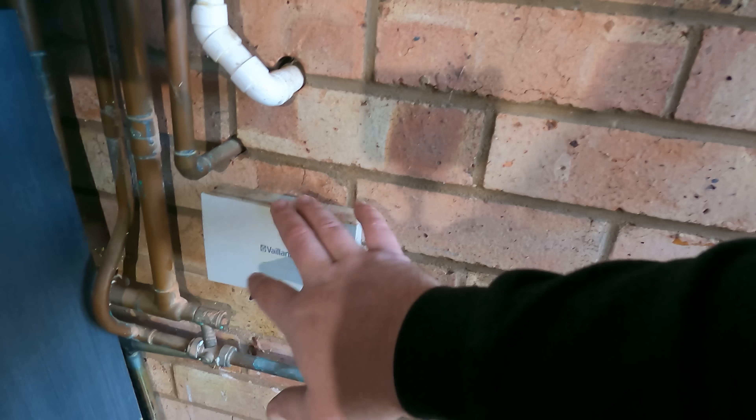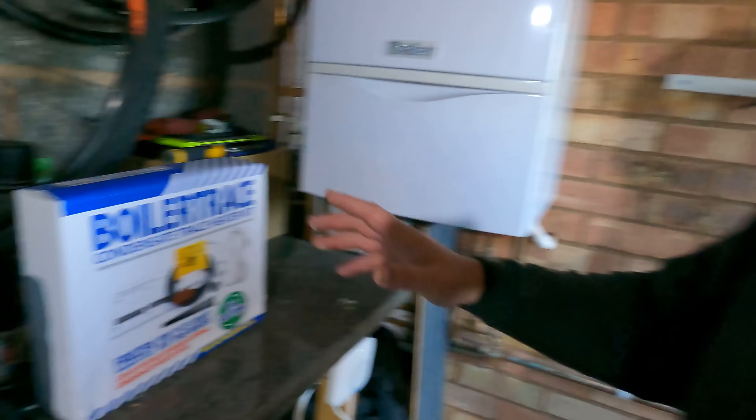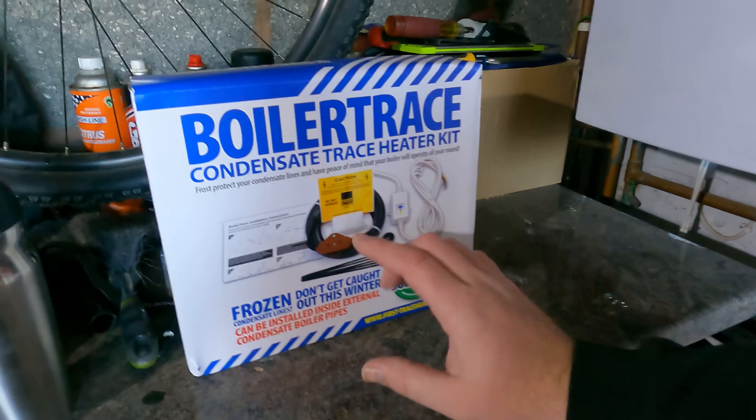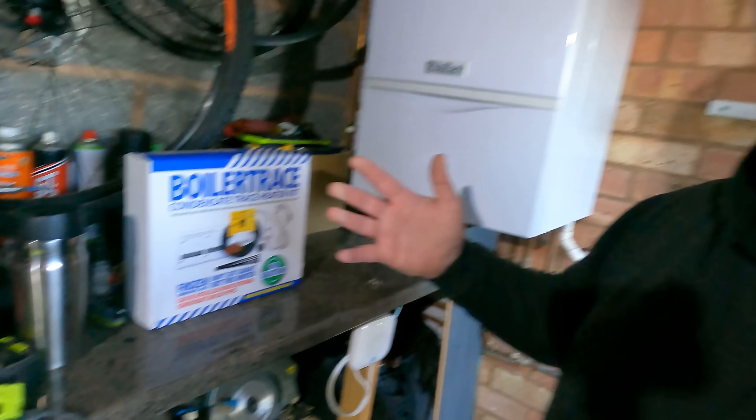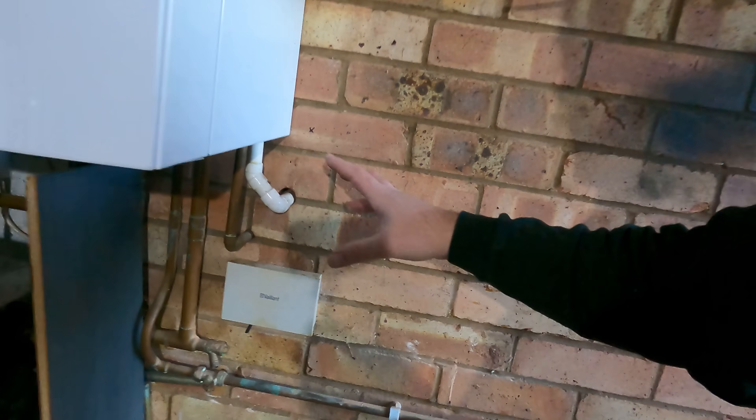What we're going to do is come through here, get rid of that, run an inch-and-a-quarter pipe and put the condensate pipe into it — externally it'll have an inch-and-a-quarter pipe. This boiler trace kit works with that pipework; it connects into the inch-and-a-quarter pipe and can run either internally or externally. It connects into a feed from the boiler, or you can use a plug — it puts a current through when the temperature drops below three degrees. First, I'm going to fit new inch-and-a-quarter waste pipe from the gully up into here, reconnect the condensate pipe, and then begin fitting the boiler trace.